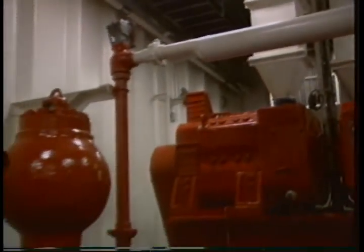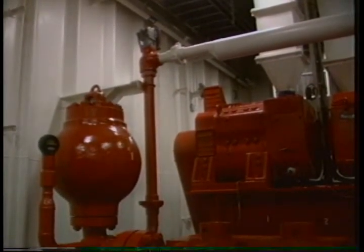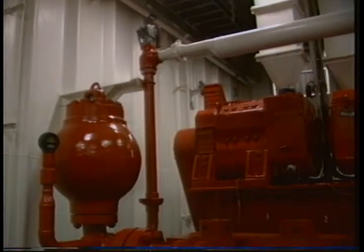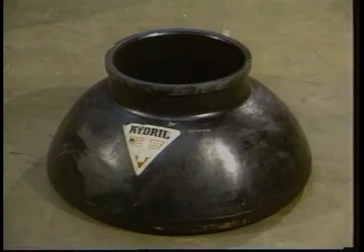Now, do you remember the shaking and vibrating in the discharge pipes? That was probably caused by a drop in pressure in the pulsation dampener. The only thing that can cause a pressure drop is a leak somewhere in the unit. It could be in the charging valve, pressure gauge, the seal between the head and body, or a rupture in the diaphragm.